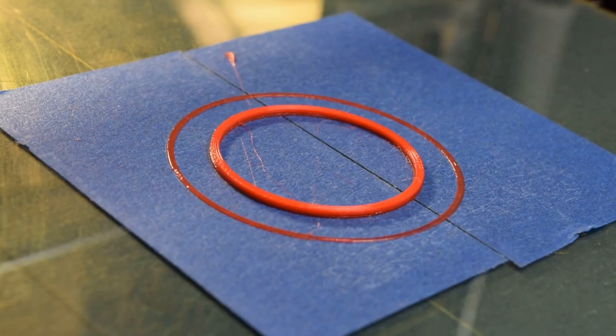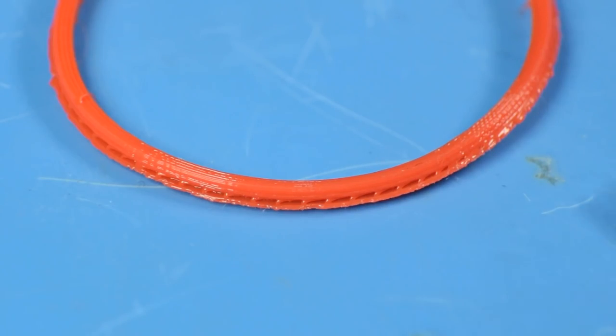I'm not super thrilled with how that belt printed, but it's good enough for now. I need to do some more calibrating with my printer, and I think I should spend some time dialing in this flexible filament a bit more. Right along here you can see my biggest problem with this. Some of the layers didn't adhere very well, and it left this gap in the middle of the print. This could lead to the belt breaking in two while it's under tension in the player.